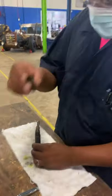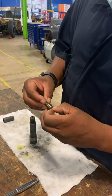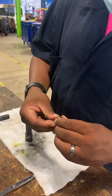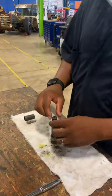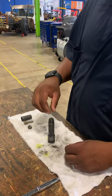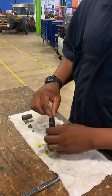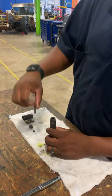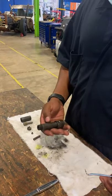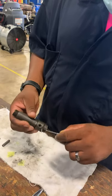I'm going to take the cap off — this is the cap. I'm going to take my nozzle off. And then on the inside of my nozzle, I've got my spray needle. Sometimes it comes out, sometimes it doesn't — this one is not coming out, so I'm going to let it be. Take this part out, and then we're going to take out our anvil. Our anvil comes out. Take the anvil out — you got your spring. Then you grab your hook. Take your o-ring off.